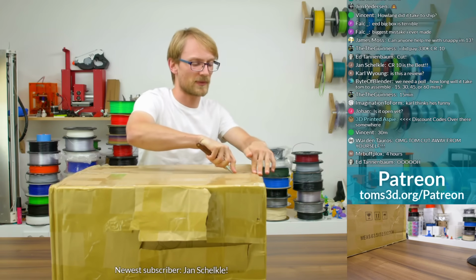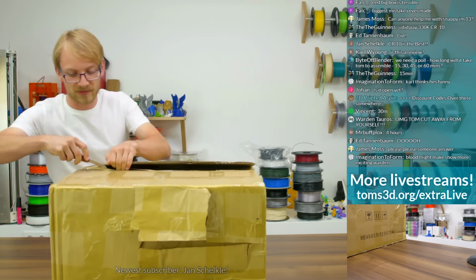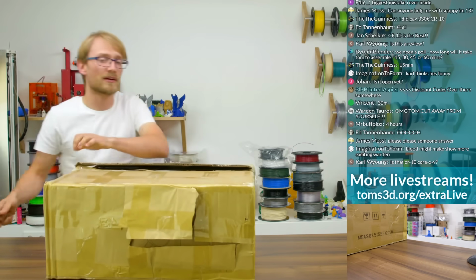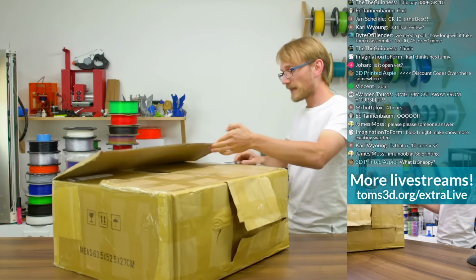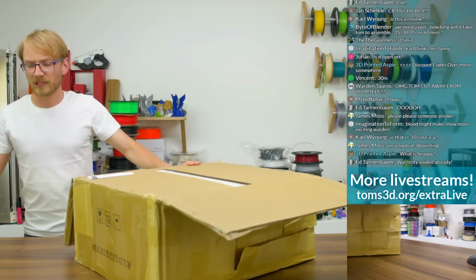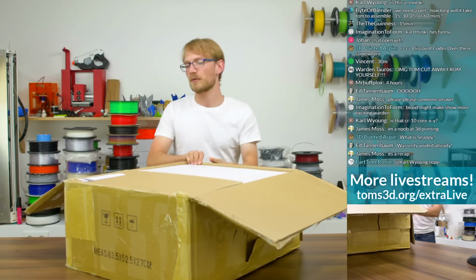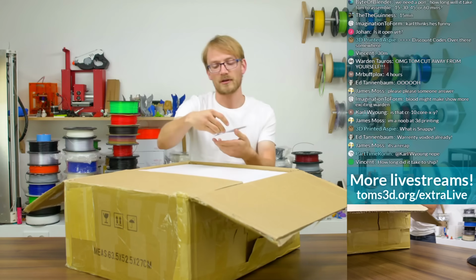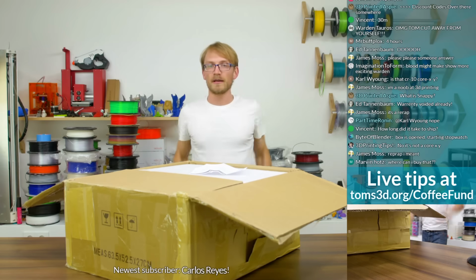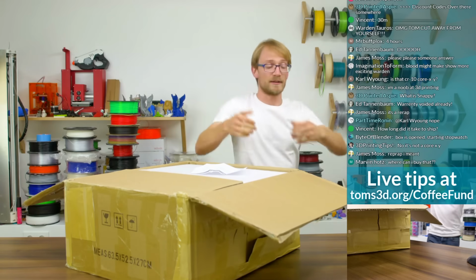It's literally like 8 screws or something. Then tweaking the linear guides, because it does use an open build style track system. Supposedly you do have to adjust those wheels. Let's see how much adjusting we need to do there. But other than that, it should be pretty well pre-built, kind of like the, which one was it? The Malyan machine or the Wanhao sheet metal machines. Those are all pretty much pre-built. The printer base comes in one piece, and then you put on the Z truss, pretty much the same way you can disassemble most i3 style printers. Okay.